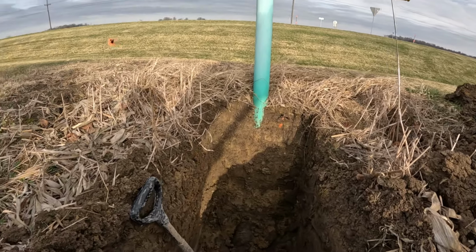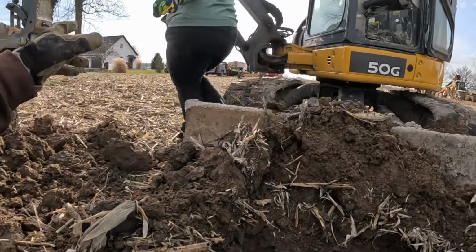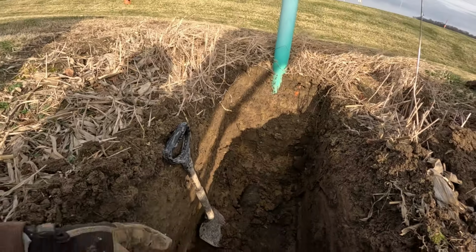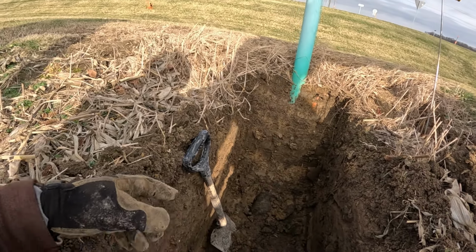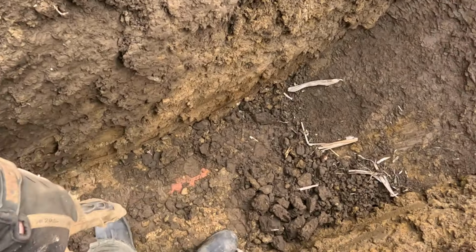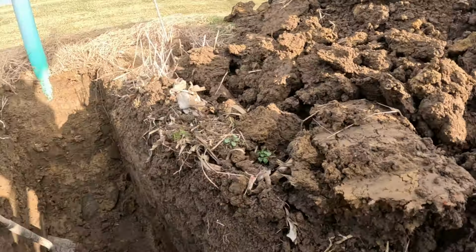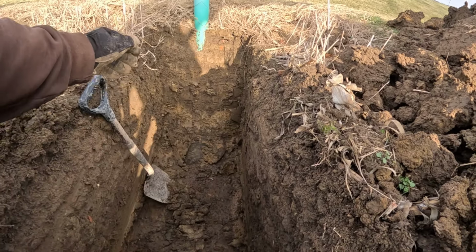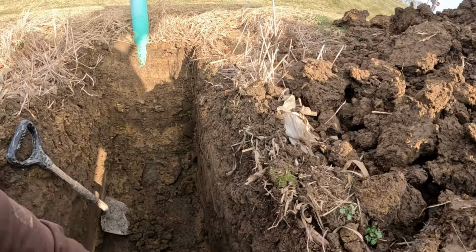We got to the bottom of where they were, so let's see that tape measure. She's getting the tape measure for us, and we got to the bottom of the standpipe. We might have enough fall. Haven't measured. I'm going to measure here in a second what fall we have, but this is the old clay line right here. You can see it. It goes straight right where we're going to go, so should be good there, but I think there's a reducer right here. I think I'm going to pull the 4-inch out of the reducer, pull this all up so we can see what's really going on.